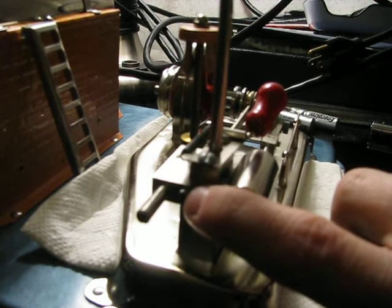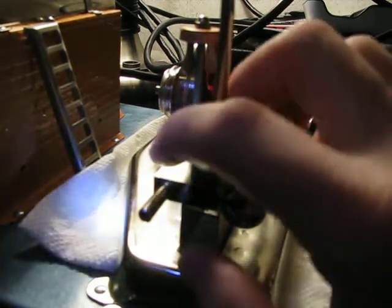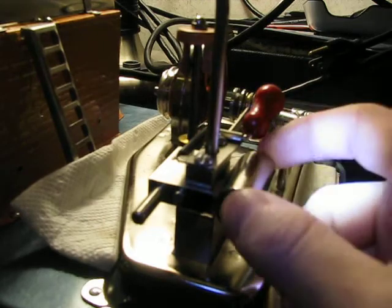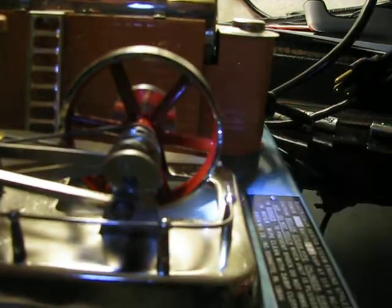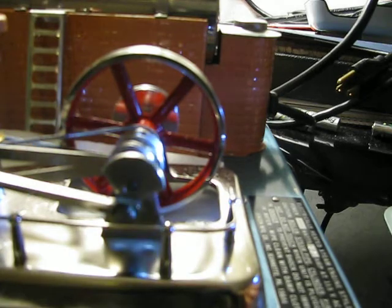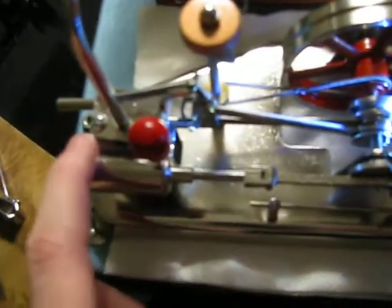This little nub — that's the valve. It's a piston-type valve. It actuates the flow between the front and the rear of the cylinder. Here's the exhaust, which is controlled by these eccentrics right here. As this thing turns, those eccentrics are connected to this right here, and that actuates the valve, which determines what side of the cylinder is exhausting and which side is intaking, or vice versa.